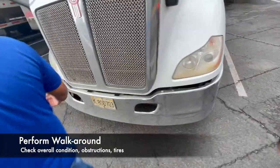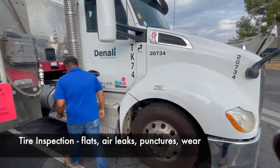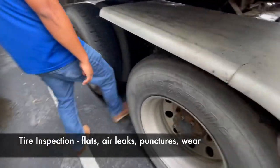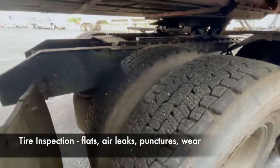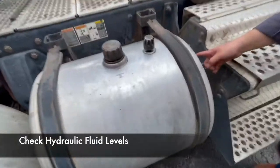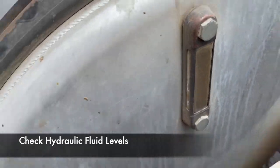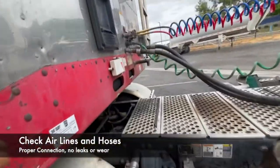Just make sure you look for flat tires. You can do a quick inspection on the tires, make sure they're properly inflated — not flat. You can also listen for air leaks; if there are any major air leaks you'll be able to hear them. This one seems pretty good. Always check your hydraulic levels — make sure they're full so your trailer functions properly. Also make sure your airlines aren't leaking and are connected properly.